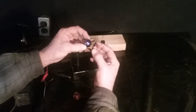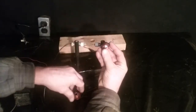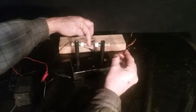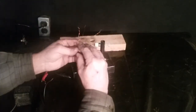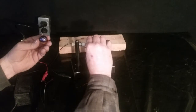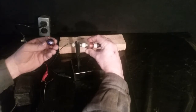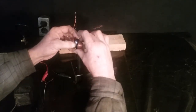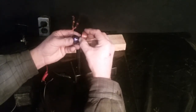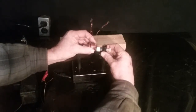And what I'll do is put this magnet south side that way in this hemisphere coil, like so, the blue side's inside, and I'll put the red side in this side, and then these are cupped so that they press against the magnet. Let me show you the holes in the coil. Let me move the nut back. I'll put them on these threaded bolts, where I can put the magnet inside both coils, with the south one way, the north the other way, and I can pinch them in there so the magnet stays up here, and it's isolated and insulated.